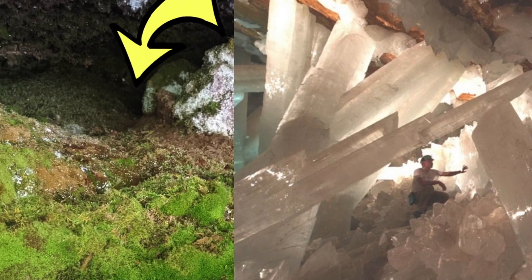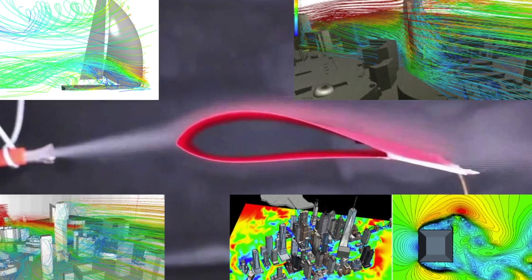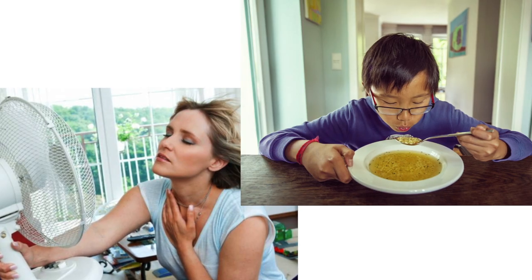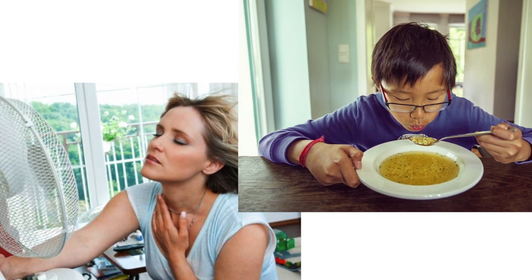In fact, there are a lot of applications that require a small anemometer with no moving parts that can accurately measure the faintest wisps of air flowing over it. The secret to creating such an instrument is to use the fact that air conducts heat, and the faster it flows over a hot surface, the faster the surface tends to cool.